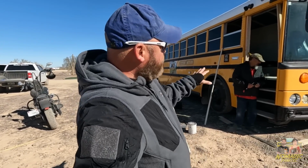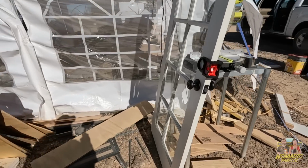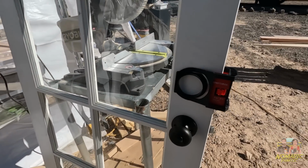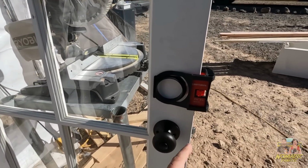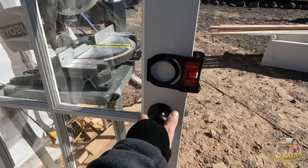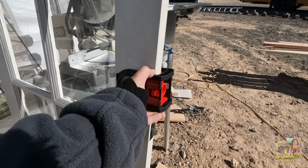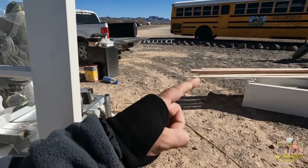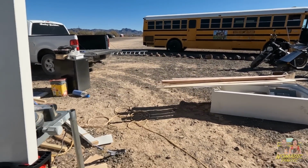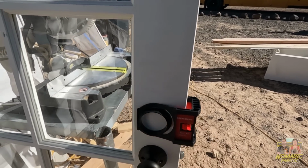While Wayne finishes up the door jamb over there before we're ready to hang the door, I'm gonna go ahead and put in that deadbolt right now. So I got this Craftsman kit, and it has 2 adjustments. So I put it on the 2 3/8 inch because it lines up perfectly with the hole that's already there for the handle. It ultimately doesn't really matter where it goes here because we're building a custom jamb on that side anyway. So I'm just gonna put it right there because I think that's where I want it.